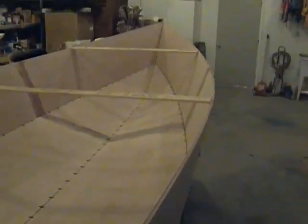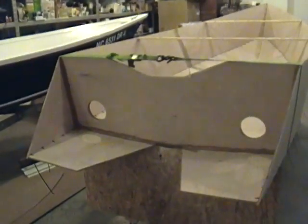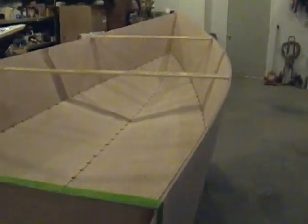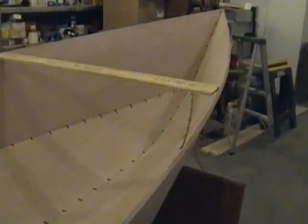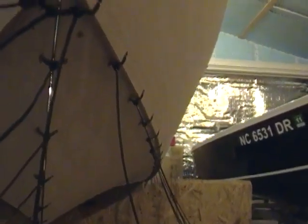You can see all the stitching is holding it together, with the exception of the transom being glued in. The holes in the transom are to access the compartments in the back of the flotation tanks that go on the back. You can see how we overlap the plywood on the front to create the chine step — we fully overlap it in the front, then slowly let it fade away on the sides, pretty much all the way to the center seat. On the inside you can also see how it's overlapped and then just fades away as you go down the side of the hull.